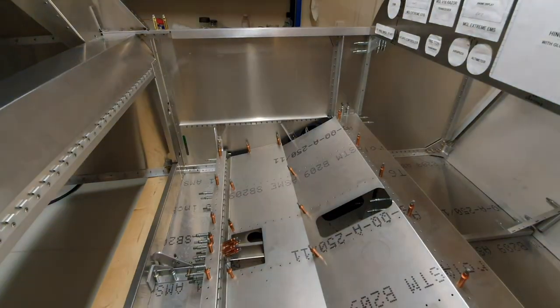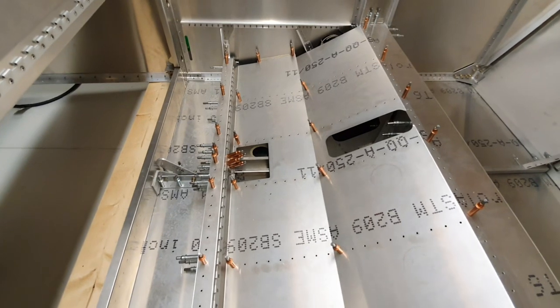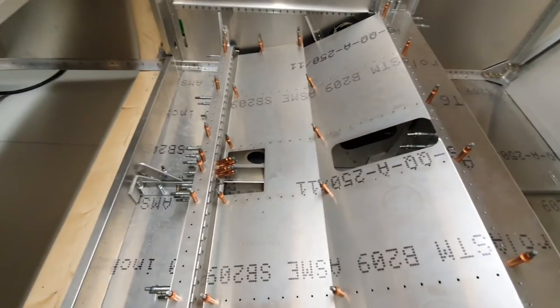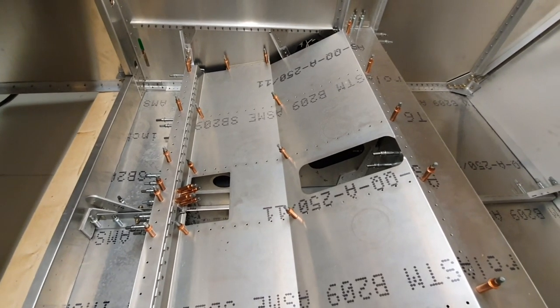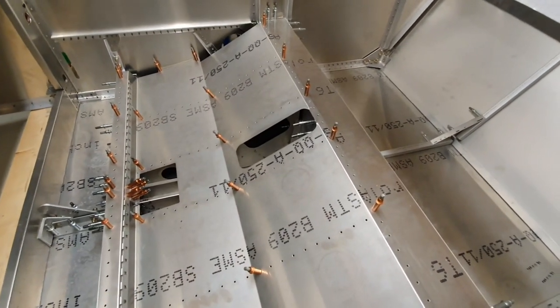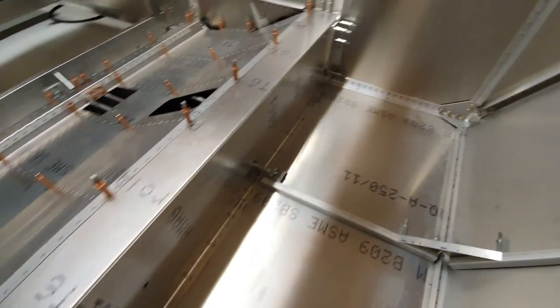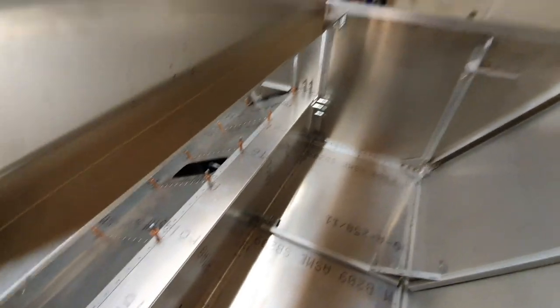So the plan at the moment is to strip out all of the components from the aft end of the forward fuselage, and basically up drill anything that hasn't been copper clecoed, and deburr everything. Deburr the floor, take it completely to pieces, deburr everything. I've got some work to do on the tunnel. I've got to have a couple of hours of work done on that as well.